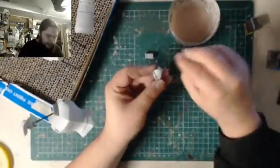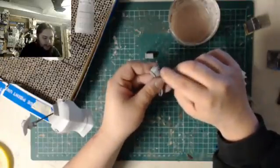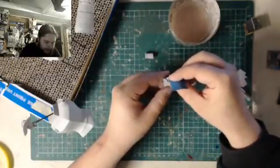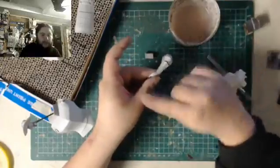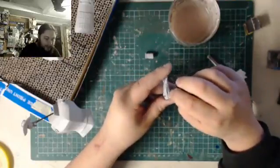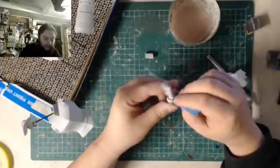Lots of detail. Just be careful when there's lots of detail in your polishing that you don't focus your polishing on an edge, because then you're just digging into the material and it's only going on the raised bit, not anywhere else. So fold it over and put the flat on the flat of the other bit and take your time on getting that. If you just put your finger over and try to do it all in a couple of swipes, all you're doing is picking off the most raised detail. You want to be focusing on the flats where the imperfections are most likely to collect. On the edges, very rarely will little dust particles or whatever settle there.